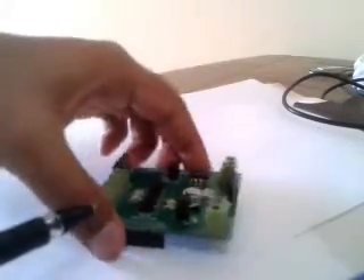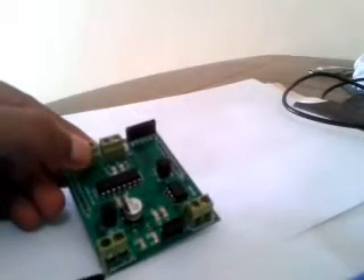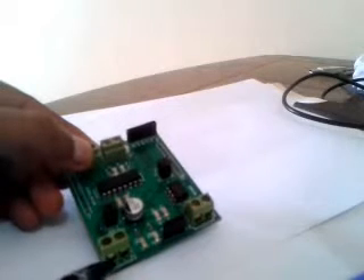There are voltage regulators under this board which can convert the voltage from 12V to 5V as well as 3V. The 5V is used for the logic section of the L293D chip and the MAX485 chip. Whatever voltage you provide here is directly used for driving the motor — so your motor will receive 12V if you supply 12V. Make sure you use the correct polarity, plus to plus and negative to negative, otherwise the power supply section will get damaged.